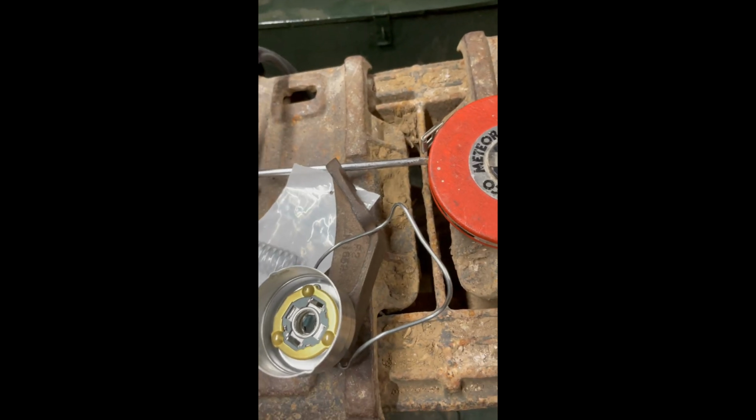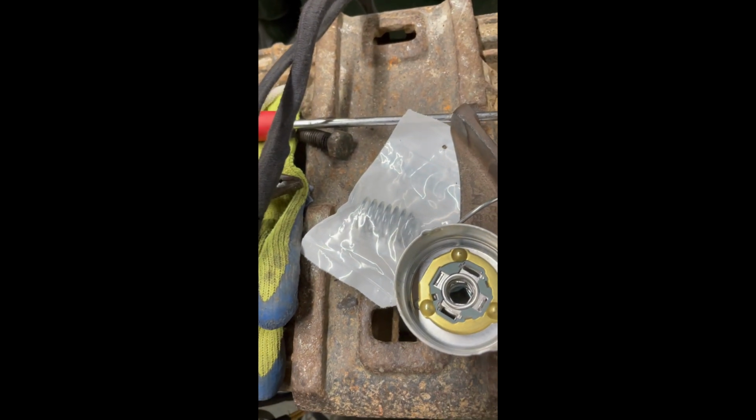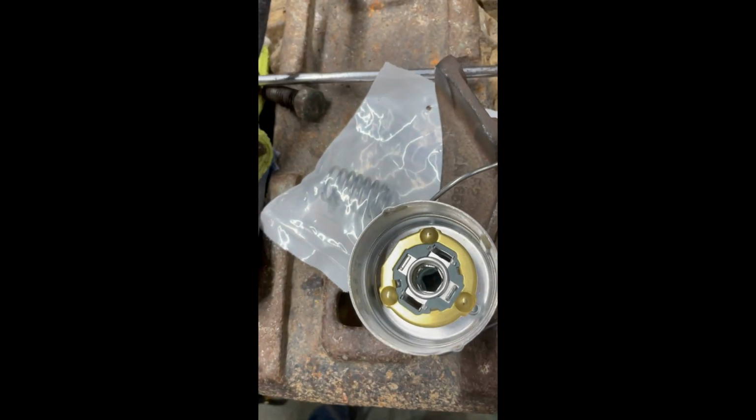So our green wire comes along, plug him over the back there. Oh, that's the other live for the horn, which comes from the Dynamo. Remember I said it earths it out, so that's the horn earth. So they're the two which will go to the horn. So we're not using those, so we'll terminate those and cut them out of the loom. There's the Dynamo.